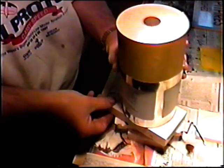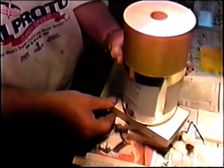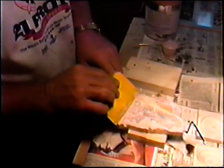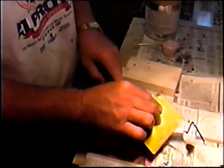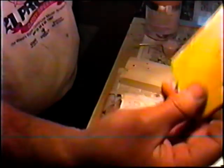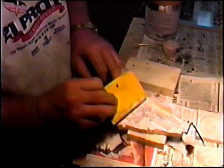I always do this and then take an impression. Of course, I've got the Teflon sheeting in there. Get that up over the corner of the mold. Just a lot of hand fooling. What's happened to this mold is every time I've used it, it's gotten a little more pitted than the time before. When I originally made this mold, using polyester resin with no carbon, it was a totally different thing. You just fill a mold and walk away. Well, you can't do that now, and I didn't have the Teflon film technology at that time either.